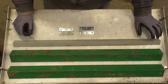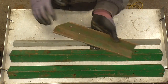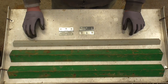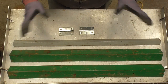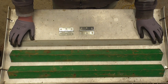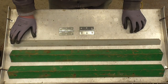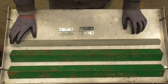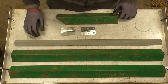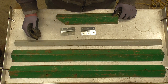I don't really want it any wider than that because I plan on mounting this bender to my vise. To do that I've got a couple of off-cuts and I'm going to weld some kind of ear onto the bottom so I can clamp it in the vise - it's basically removable, so I can pop it on the vise, bend my metal, then take it away and stand it up in a corner out of the way. I don't have enough space in this garage to have something permanently mounted to a bench, so I need to keep as much space free as possible. If you're mounting yours onto a bench, you'll probably want to create a couple of ears to bolt through onto the bench.